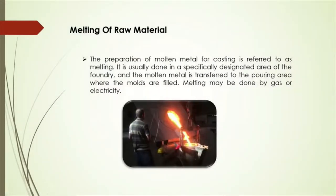In the melting department, induction furnaces are used. In this furnace, pig iron, borings, and scrap iron are heated up to 1430 to 1500 degrees Celsius. Once the correct temperature is reached, the ladle is preheated and the metal is tapped into the ladle. During the tapping, inoculation is added. This inoculation is important for flowability, machinability, and to control the cool-down period. Once the tapping is completed, the metal is poured into the molds.